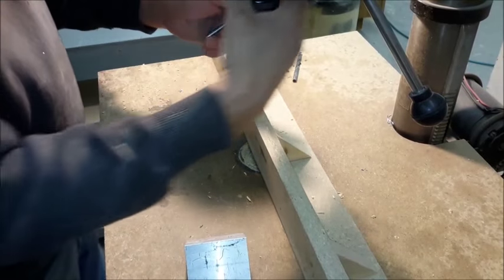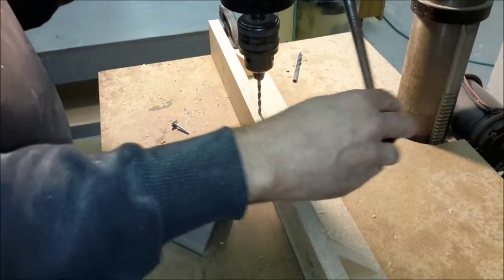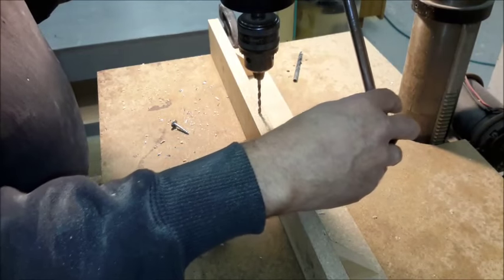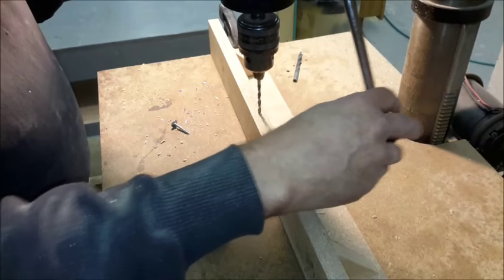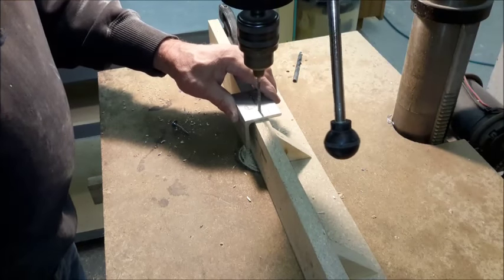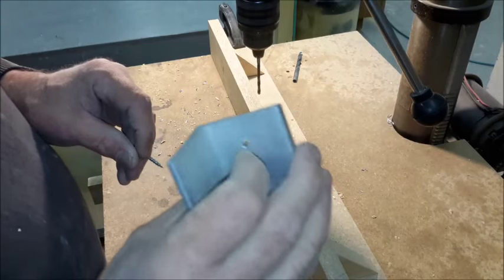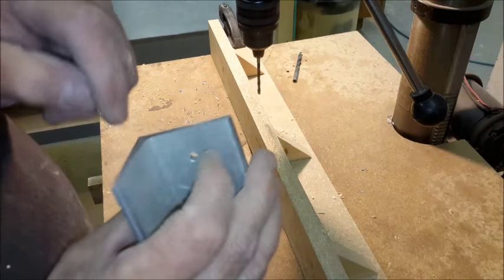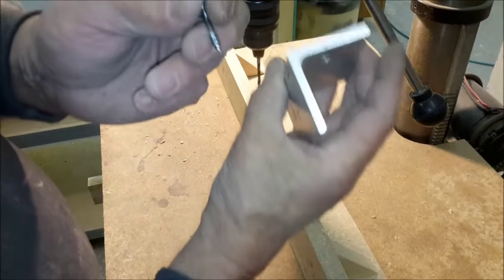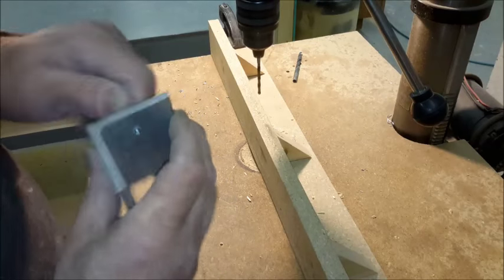There's three holes in the chuck for a reason. Use every one of them. I'm resetting the depth stop because I changed the bit. Another reason you want to set the bit so that it barely breaks through is so if you have it so that it goes deeper this way, especially with steel, it'll have a chance to grab and suck it up in your hand. Oh yeah, see now, even that's just a little tight. Daggone it.